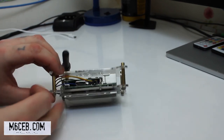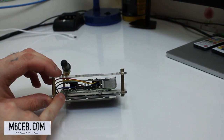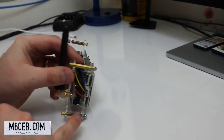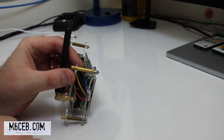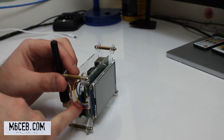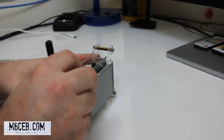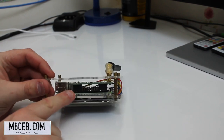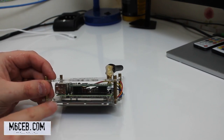If we tilt it down, you can see this is just a Raspberry Pi 3 — they're very inexpensive, about 20 quid. It has an SD card slot. You basically install the Pi-Star software, which tells the Raspberry Pi what it's supposed to be doing. You've got the MMDVM board on top — it just pushes in on the pins. You don't even need to do any soldering; the MMDVM literally just pushes straight on top of the Raspberry Pi.